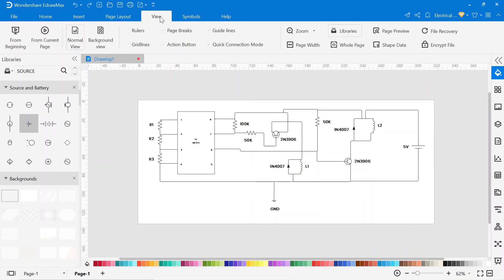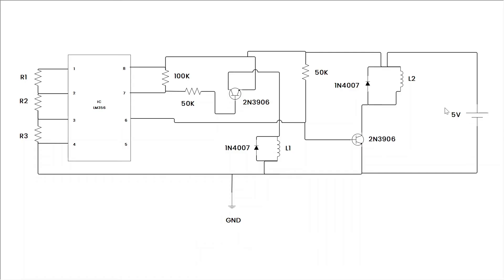Now our circuit is completed. Let's learn how this circuit works. The whole circuit gets power from a 5 volt battery. This IC plays a major role in the circuit — it has a feature like an interior temperature sensor. Pin 2 and pin 3 are two stable temperature trip points. Whenever the temperature increases above a certain amount, the output goes low. Similarly, when the temperature decreases below a certain amount, the output goes high. Output 2 also becomes high when the temperature goes below a certain amount and becomes low when the temperature goes high. The output signal activates these two transistors, and these two transistors activate the relays.